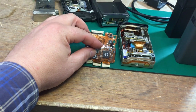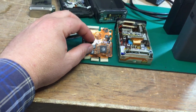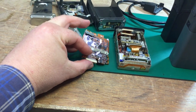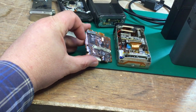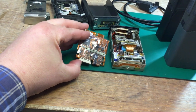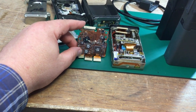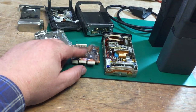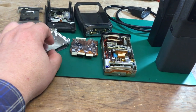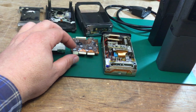The controller flex was quite advanced for its day — it's not a solid PCB but a flexible tape PCB on a metal backing, sandwiched in the middle, and it opens up like a book. This was quite new technology at the time, along with BGA devices with connections around the edges. It was very advanced really, considering we had only just moved from crystal radios to synthesized radios.